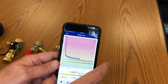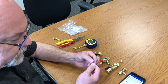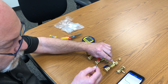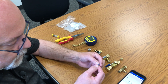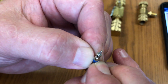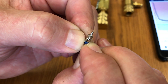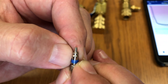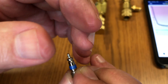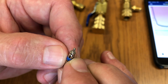This really is an issue. Let me explain what it is. This is a vacuum core — a valve core. This is what we would pull out in order to get flow. It's also the same core that's on the side of the core tool. If we open this thing up, there's just a tiny hole that opens. When this is just cracked off the seat, you get a small film of oil around it. That oil will, just from surface tension, bubble and break, bubble and break — and that's what you're seeing: that sawtooth line.